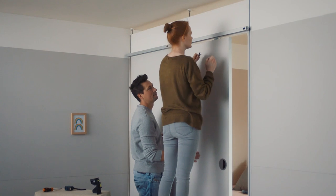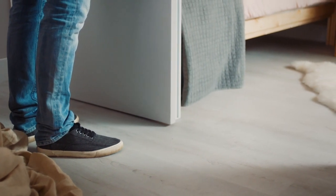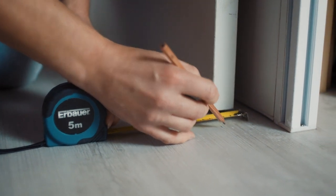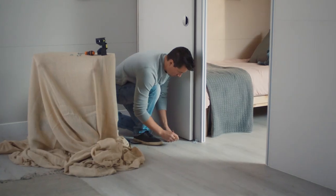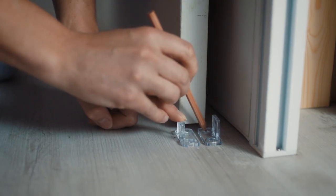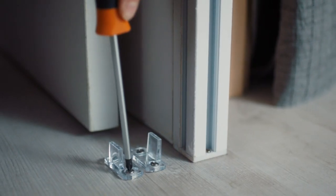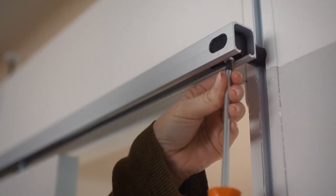The next step is to fix the door runners to the floor, directly in front of the post which the door slides past to open. Measure the thickness of the door and add four millimeters — the gap between the runners is this wide to allow the door to easily slide through. With the door hanging in place, mark where the runners need to go through the pre-drilled holes. Ensure there are no cables or pipework, then screw into place using appropriate fittings.